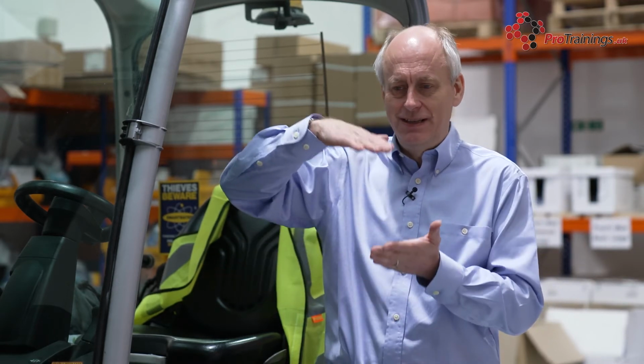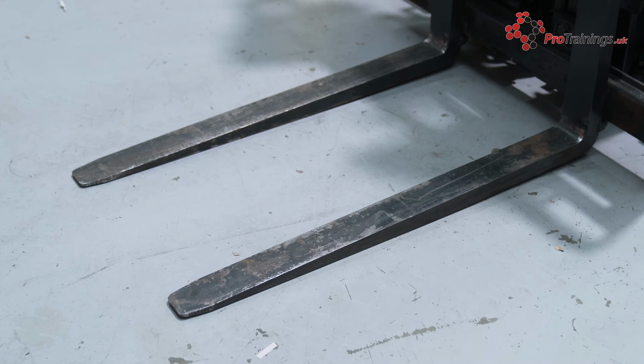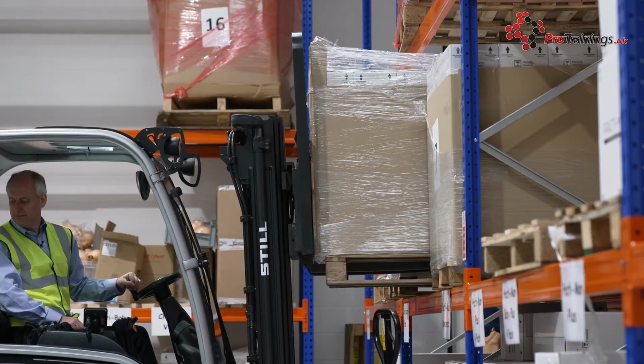The other one is the trip hazard. So normally when you're looking through at the forklift tines, the tips should be down, and they shouldn't be up at all, so they're laying flat onto the floor to reduce the amount of trip hazard as possible should someone walk in front of the tines and then cause a trip. So if you did see a forklift truck parked with the tines up or spikes sticking up at the front, then you need to be telling somebody about that so that it can get rectified.